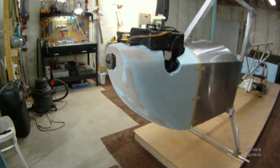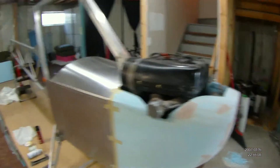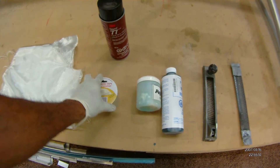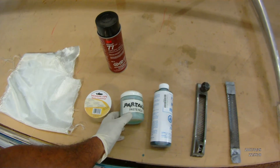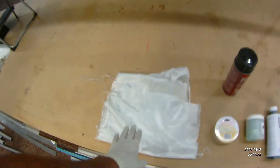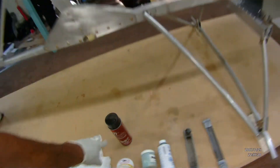It was an awful lot of work — carving, shaping, sanding, and tracking blue foam all over the house. Anyways, it's about 97% there. Next step is to cover it with packaging tape, then rub it down with releasing wax — five coats of that — and then I bought this mold releasing agent today that goes on before the fiberglass layup.